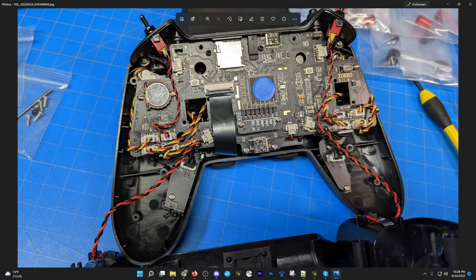I do have a picture I took, and one of the things I wanted to point out were some mistakes I made to save you some time. So here's the picture — hopefully you can see my cursor. We've got the battery leads coming into these connectors. I always recommend taking a picture before you start tearing stuff apart, whether it's a radio or a quad — that way you know where the wires went and how they're routed. This wire comes down here and we've got a slider up here, it comes around over here and down to the bottom too. Those come from your actual gimbals and you can just follow them around. On this side they routed one of the cables from the gimbal out around here — that really wasn't a big deal.